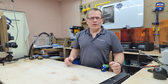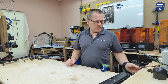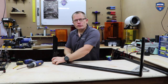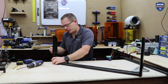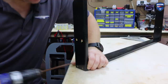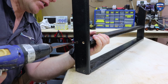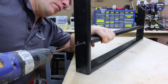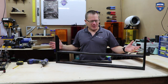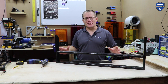So we're back from outside — all the wood has been cut, painted, and you've seen it being created on the CNC machine. That just leaves me now to assemble the basic frame. These screws are a little bit long; I think these are two and a half inch — I would have preferred two inch, but that's all I've got at the moment. Believe it or not, that is the basic frame: four pieces of wood, very simple, just butt jointed with a couple of screws. Nothing hard to do there.